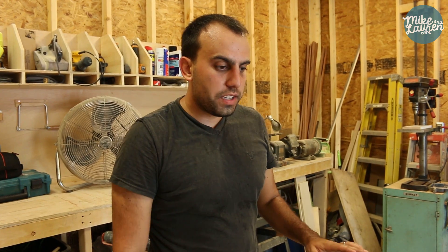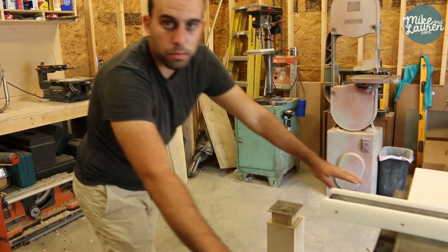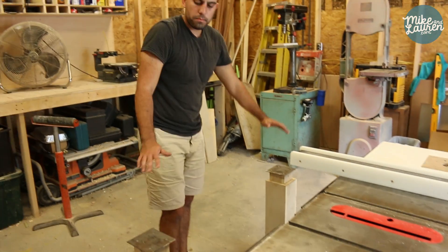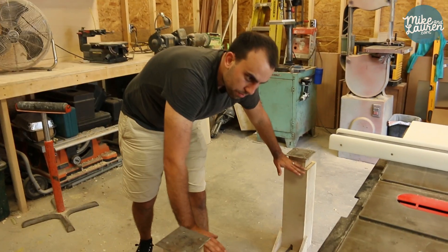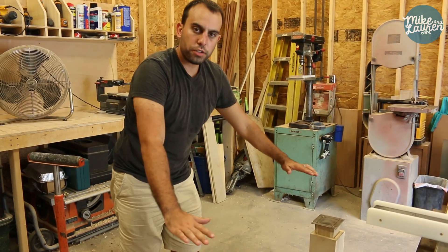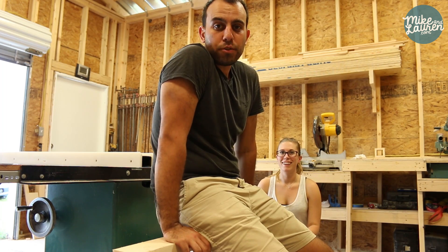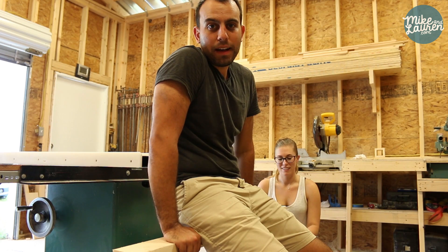It's not any secret that this is some sort of adjustable height workbench, but I'm not going to tell you quite yet what I'm building it for. I wanted a way to have an outfeed table coming out of the table saw most of the time, and then when I want something on the middle shelf, I can pull the top off, raise it up, and the middle shelf becomes the top shelf. Since it's made with 2,000 pound trailer jacks, there is no question about its strength.